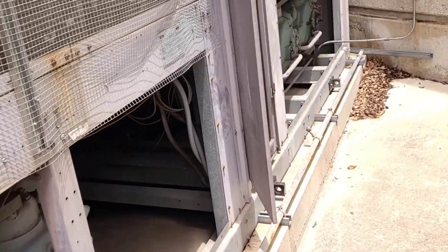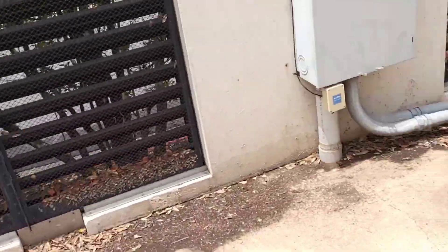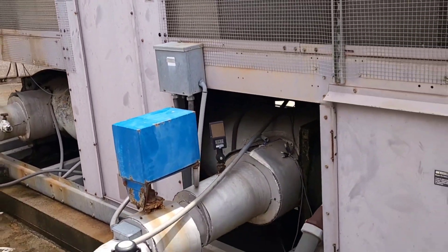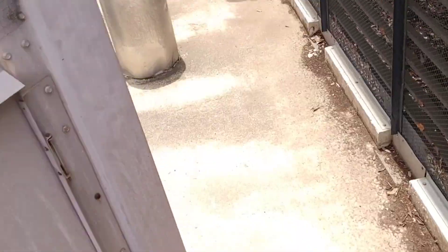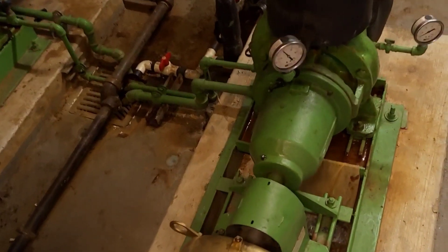It is online, calling for stage one, didn't have any alarms — it's got it under control. I'm pretty sure the problem with this one was the set point was too low. We'll go check the pumps now just to make sure they look okay, but I'm pretty confident they're not going to be an issue. Here are our pumps — this is building B.